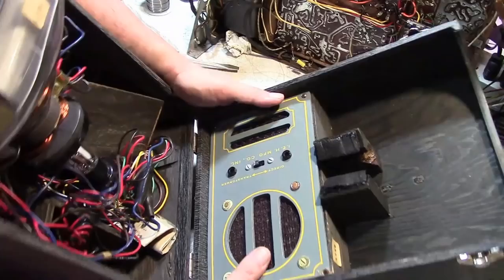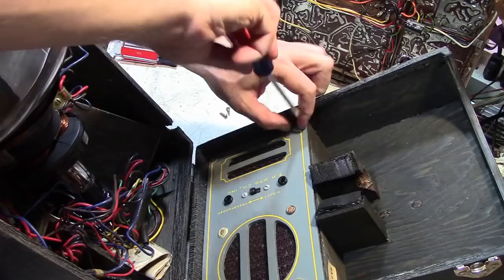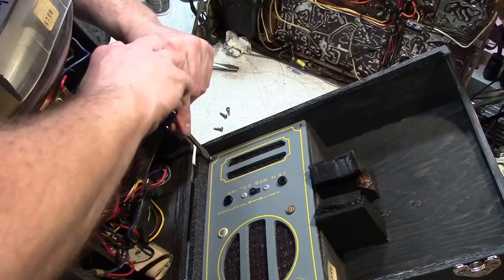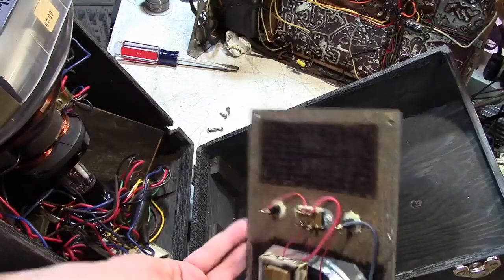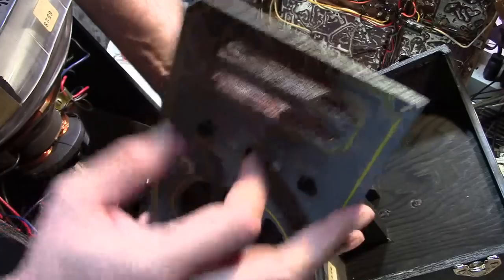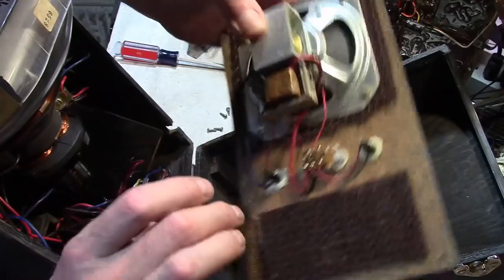There's an oval one up here and it looks like there's two speakers in there — one of them will have an output transformer on it and one of them will just be a direct connection to the voice coil. It's not the most sturdily constructed of devices. They fooled me — there's nothing down there. Small permanent magnet speaker, output transformer, and a switch. There's a frozen switch — I'll shoot some contact cleaner in there. It probably hasn't been flipped in a very long time. Everything's got a nice patina of corrosion on it.